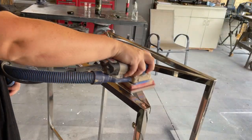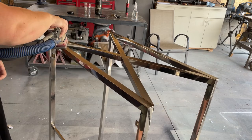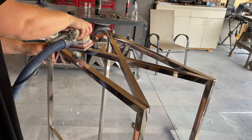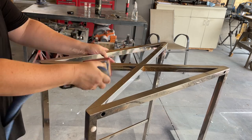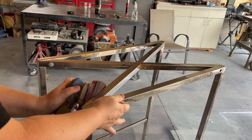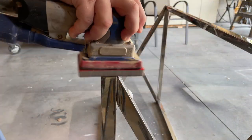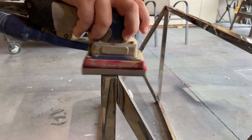Once it had enough time to dry off in the sun, I gave it a scuff sand with a medium grit sanding pad on my surf prep sander. Scuff sanding like this is always a step you can do really quick and easily by hand. All I wanted to do was just scratch up the super shiny, slick surface and give my paint every opportunity to make a really good bond, just like I would do on wood or laminate furniture.